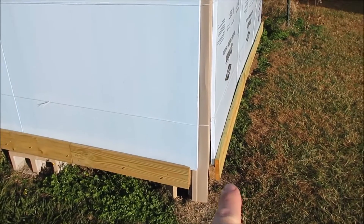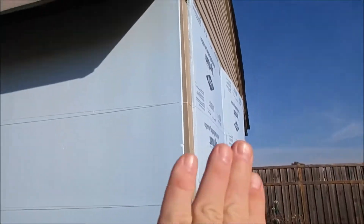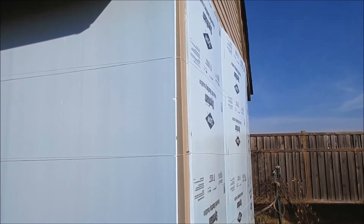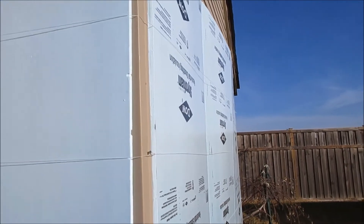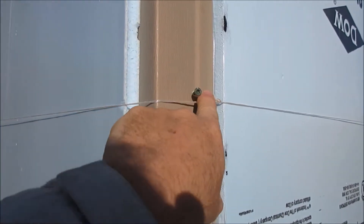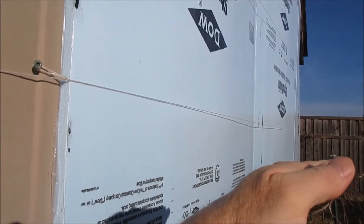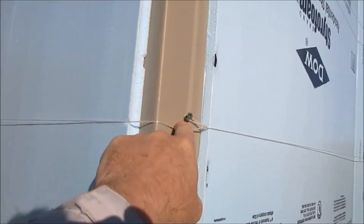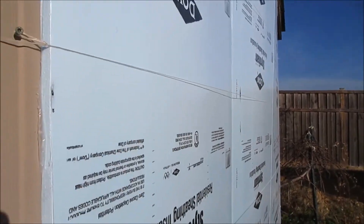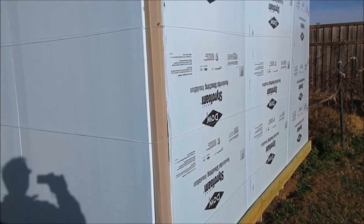I made these troughs — basically a treated two-by-four with a deck board to create a trough for the foam to sit on. I lean it up against the greenhouse, take a decking screw, tie a piece of tomato twine to it, and pull it across. The first three panels have a loop to keep them from falling while I get the other two up, then I wrap the twine all the way around to hold them all.